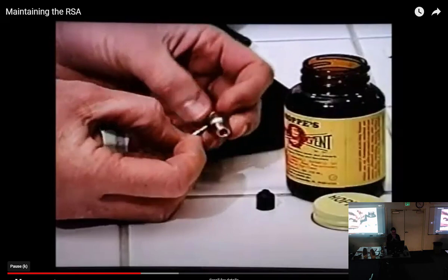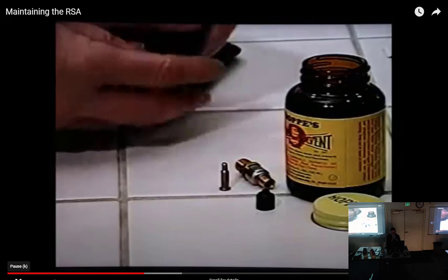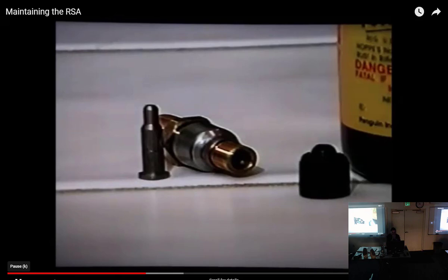If you're only cleaning the restrictors, which is permitted between annual inspections, work with each cylinder separately by removing, cleaning, inspecting, and reinstalling the restrictor and reconnecting the fuel line. Remember, if you lose a fuel restrictor, you'll have to buy an entire new nozzle body assembly. These restrictors are flow matched to their respective bodies and are only sold as assemblies.